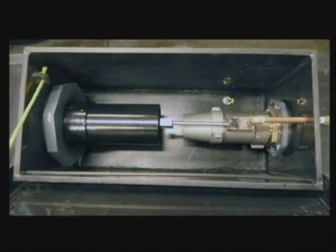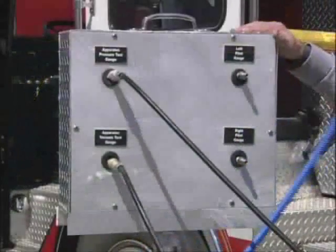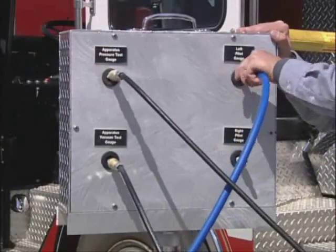You can perform pump tests using one or both manifolds — the choice is yours. Water flow is measured at the flow stations with pitot meters and a various range of tips. Special water flow receiving tubes in each pitot station are designed to eliminate water spillage and waste. The pitot reading is then transferred through hoses with quick connects to the portable pump test monitor.